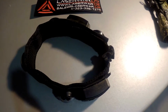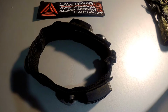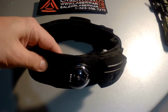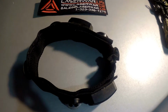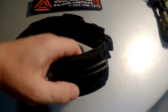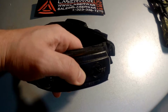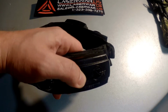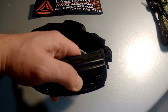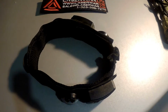So the next step is updating of your headband firmware from 9th generation to 10th generation. To do it, you should have 9th generation so-called RGB headband, and you should run it in admin mode. To run it in admin mode, you should press the power on button for 10 seconds. 1, 2, 3, 4, 5, 6, 7, 8, 9, 10. The headband runs into admin mode.